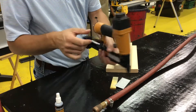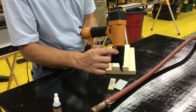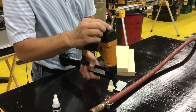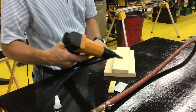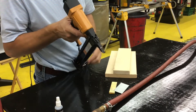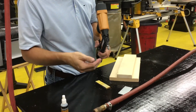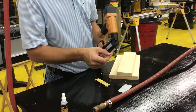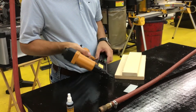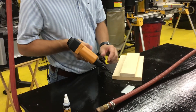One thing that may scare you when you start off is the air direction up here. When this nail gun fires and it pushes the nail, brad, or staple into the actual piece of wood, it shoots the leftover air out. If that is facing towards you, that could startle you. Also, right here on the front, you can turn this counterclockwise or clockwise to adjust the actual depth of the nail going into the wood. If the air compressor is running and you have a lot of pressure, you may need to release it so it doesn't drive the nail as far into the wood. Versus if you don't have a lot of pressure, you can engage it to set it deeper. It's all dependent on what kind of material you're using — thick material may need it to go deeper, while thinner material you may not want it to rip through.